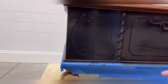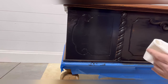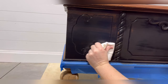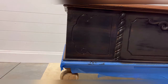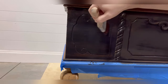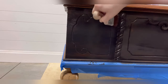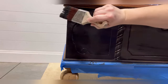Once I get the paint on to my liking, I come back with a paper towel to wipe back any excess paint and reveal the underlying wood. This particular paper towel is not my favorite because it has lines or grooves cut into it as a design, so it puts a little more lines in my paint finish than I'd like. I would ideally use a Viva paper towel that doesn't have grooves, so it wipes back in a smoother fashion.